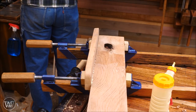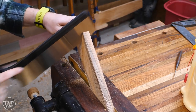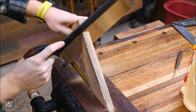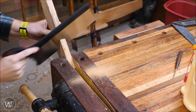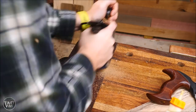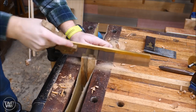I just need to make the supporting structure for underneath. On the supporting board that goes along the back there are two angular cleat pieces that come out on either end to actually support the weight of the shelf. For these I'm just cutting them at 45 degrees — I'll cut down as far as the saw can, then flip it over and cut the rest away. I'm just following a line and cutting along it. That's going to leave the edge slightly rough, and I can just put it in the vise and clean that up quickly. The 45-degree grain really cleans up nicely and I really enjoy that part.